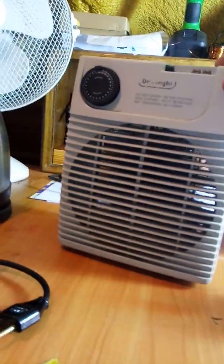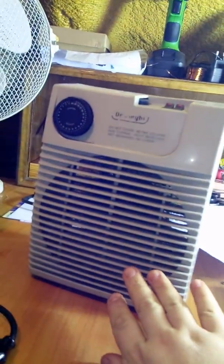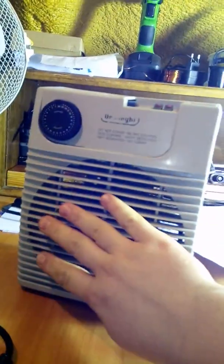Wow, this lamp is hugely bright — oh my god. As the lamp progresses in warm-up, the fan inside this thing is getting slower and slower, barely spinning anymore, and the heat output is almost non-existent. The arc is now almost at full brightness and it is limiting the current that can be drawn from this thing — at least that is how I explain it.